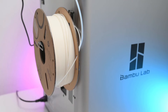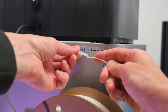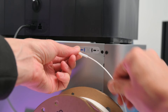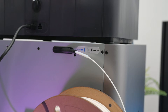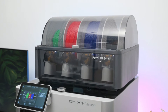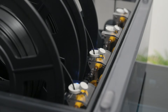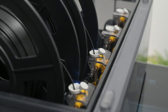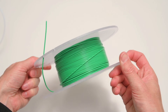Cardboard spools and TPU are best loaded separately on the back spool holder, and it's recommended to load highly abrasive materials directly to the printer without using the AMS to avoid additional wear. I find the AMS is a brilliant unit — having different colours and materials loaded and ready to go makes sending prints quick and easy. Having the backup spool option in the AMS is excellent for production work while making larger printed parts. For the first print we will be using the included green PLA sample.